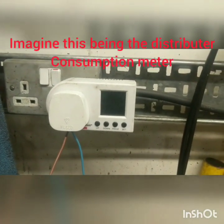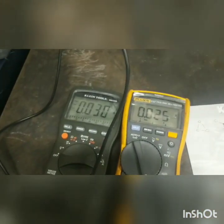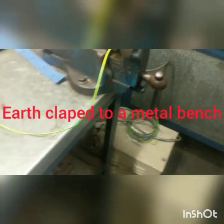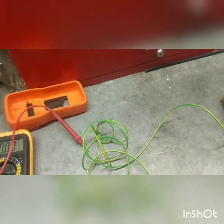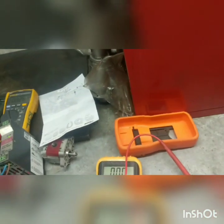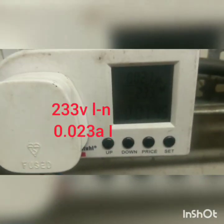About to make a makeshift energy meter. I've got live and neutral for a couple of our meters — the one on the right is the only one that's calibrated, that's the neutral. The one on the left is live, going into a simple load, then coming off a shoddy earth. I have exactly the same problem in this country as you do. I'm at work and there's a 2,000 amp transformer less than 50 yards away, so getting a shoddy earth was quite difficult. I've put a load on the end of the earth — 233 volts line to neutral.